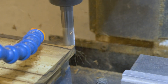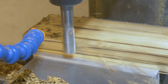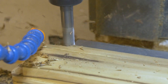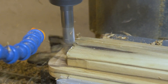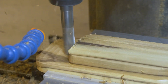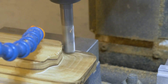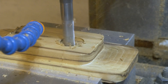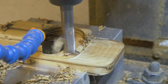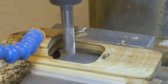This footage is sped up at about 400%, but same feeds and speeds — 3,000 RPM, 8 thousandths feed per tooth, 72 inches per minute. We're coming in from the outside in up until a point. I do this in a funny way and I'm not sure if it's right, but it's the best way I've found to face a side that already has internal cutouts in it. When I do just a straight facing operation and let the tool path collapse all the way in, it chips the corners as it comes to the hollow points. So I found that ramping from the inside out prevents that, but maybe there's a better way.